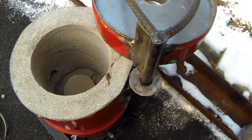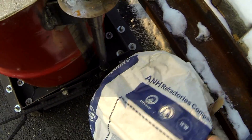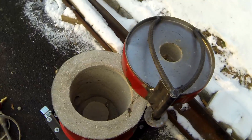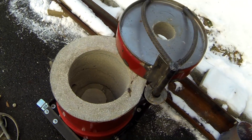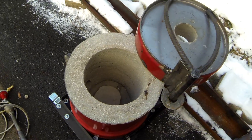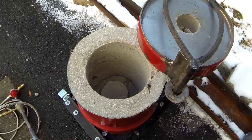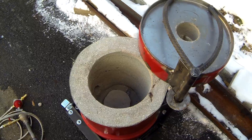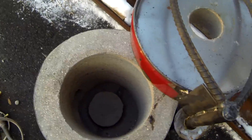As far as the refractory cement, I used KS4. I recommend using refractory cement — a lot of people use four parts perlite to one part chimney cement, but you'll find that it'll crack eventually and you've got to keep lining the furnace with fresh layers to fill in those cracks. This refractory cement is rated to 2,550 degrees, so you'll be able to melt all sorts of metals.